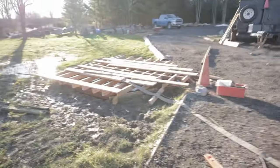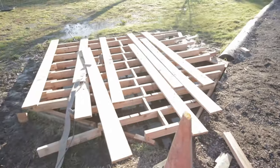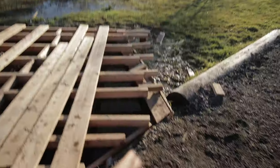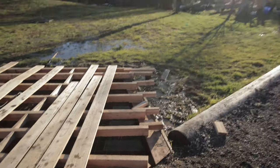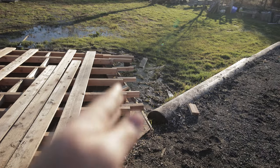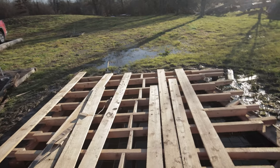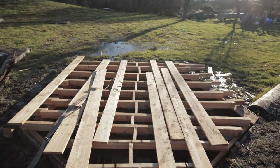The snow melted pretty much. I had some time to get back at the deck here about a week later. Unfortunately I've got to extend the deck — I've got to make the edge of it square. I'm not doing this octagon thing, it's just getting crazy. So I'm just scabbing some pieces out. I'm going to have to put some stone down — I've got some field stones, I'm going to build it up for some supports. A lot of the stuff I do out here is eyeballed. I just put a little bit of blocking in the middle there to firm it up a bit.